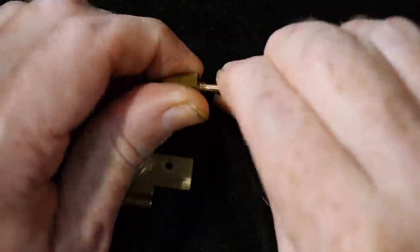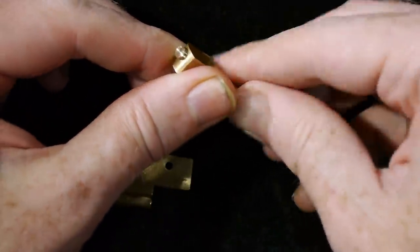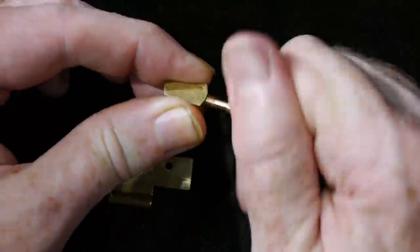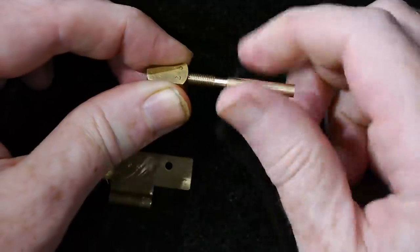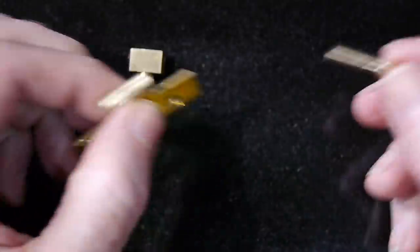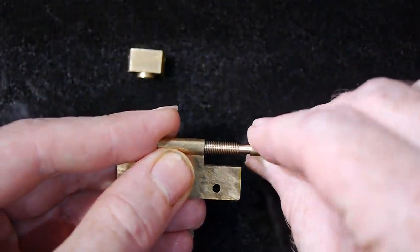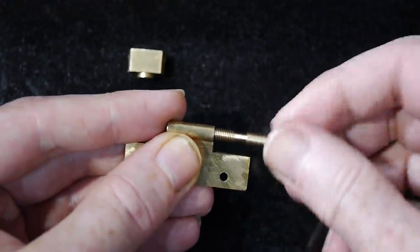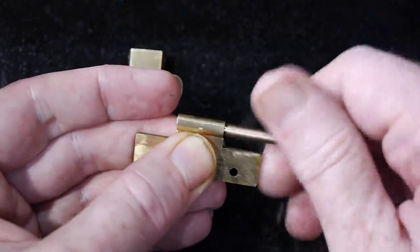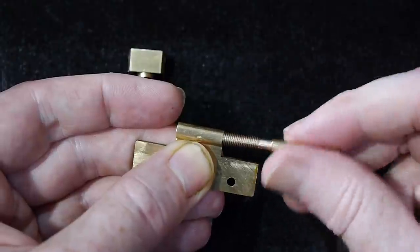It fits smoothly in the first nut right up to near the end, where there was a bit of resistance due to some burring inside the nut. The second nut fit much more freely, probably because it's pretty badly worn. Once I have the screws in good shape, I'll consider remaking the nuts as well. This doesn't tell me that my thread is perfect by any means, but at least it tells me that the thread isn't grossly inaccurate.